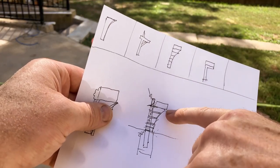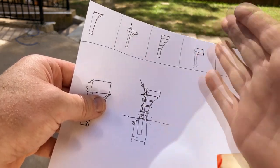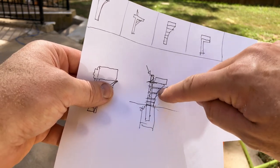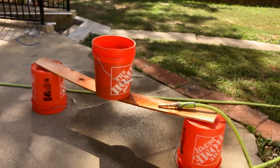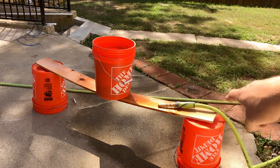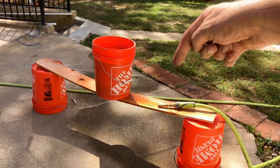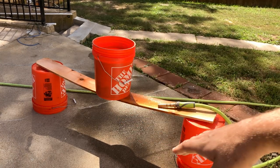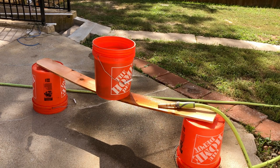To get the curved piece, we're going to bend a piece of cedar. Once it's bent, it'll give us a good template to trace and cut the curve perfectly, and we can also use the cedar itself as filler for that area. Right now I have a piece of cedar fence between two buckets with a heavy bucket of bird seed on top, with water trickling down. As the sun hits it and warms it — just like bending a guitar side — it'll bend slowly.